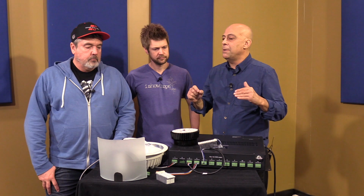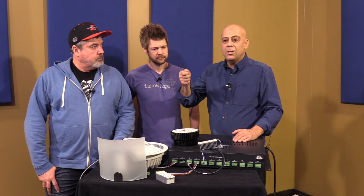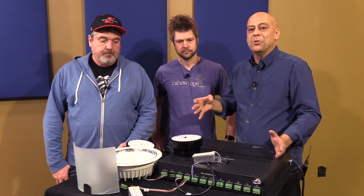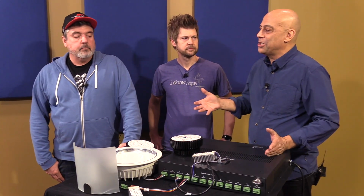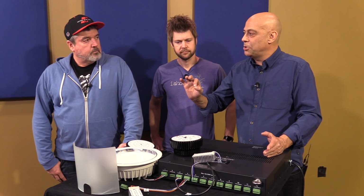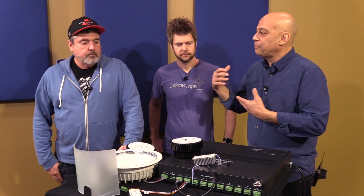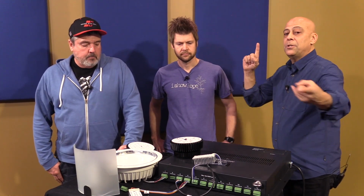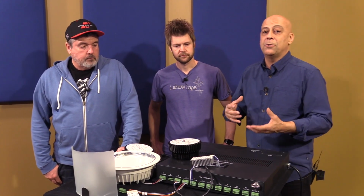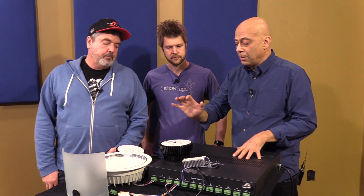And it's pulse dimming, which if you notice with your residential LEDs, when you dim them and they get to the bottom, they shut off. Yeah. And that's because there's no more electricity to control the electronics. And when you turn them up slowly, they won't turn on until you get to a certain volume, and they pop on. Why? They need electricity for the electronics because they're DC, they're not AC, and you cannot dim LEDs the traditional way with resistance or triac dimming. Yeah. It's all built in.